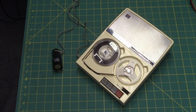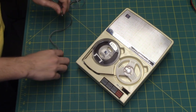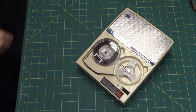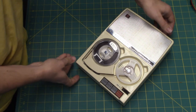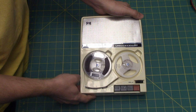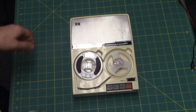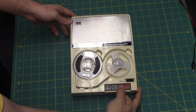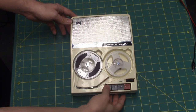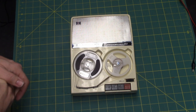As you heard earlier, this recorder is rim drive and AC bias, and has a surprisingly well-made transport mechanism with lots of precisely machined parts, lots of metal, and also a small flywheel so that there's plenty of torque on the rim drive. It's a very interesting recording machine for sure, and of course you've already seen a number of things.